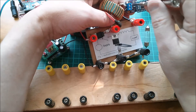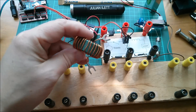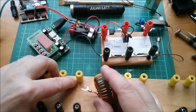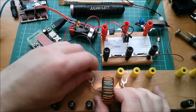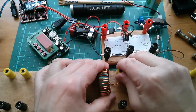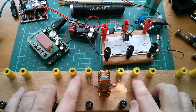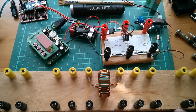Let's make a start. I'll get that inductor — I'll probably be using the bigger inductor — get it off there, unscrew that terminal post. We'll use this bigger inductor so I can keep the frequency lower, which means I can carry on using the opto-isolator MOSFET driver. That's going to go there. These terminal posts are lower down on the wood, so I'll probably have to make some bends to this. That looks pretty good — I can put that in across these two points here. I only want one item per terminal post to stop the rotation that happens when you tighten these up, so those will be linked underneath.